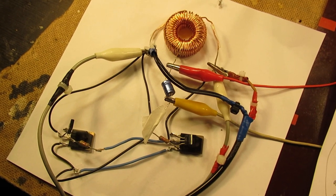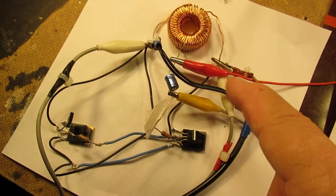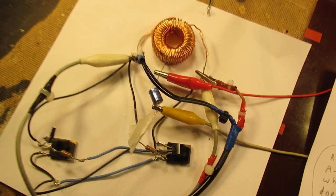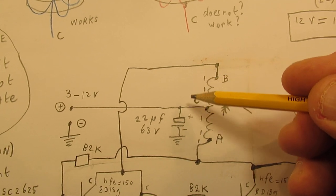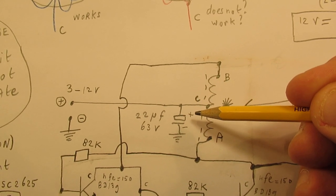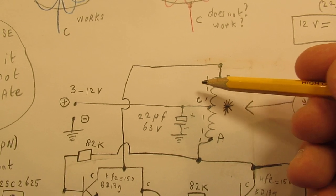It's a resonant circuit, self-resonant. Every change here in capacitance, inductance, the length of the wiring, perhaps even the supply capacitor, etc., can change the frequency. But in general, this coil sets the frequency where it all works. And when you want to go to a lower frequency, connect between this location A and B, say a capacitor of 100 picofarad or 200 picofarad. That could help to bring the frequency down and could also correct the waveform in a certain way. Could be useful.